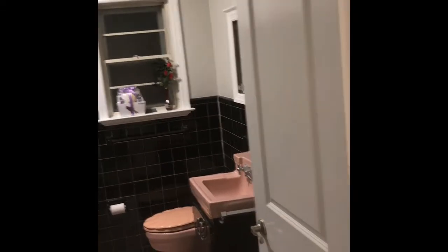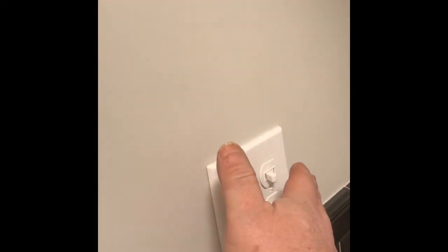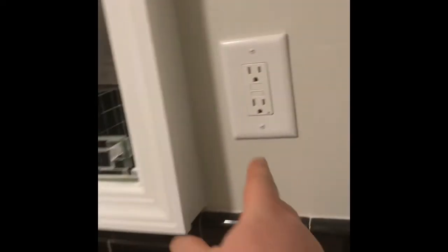This bathroom door used to open the other way and we changed it. Here's what a hinge used to look like — we could do a better job on the next one, but if you never knew it was there, you'd never know. We had to cut that in there, get the lock set — here's where the old lock set was — and we had to mortise new hinges in. Before, the door used to open this way and the light switch used to be way over here, so we moved it so when you walk in the room you can turn it on.